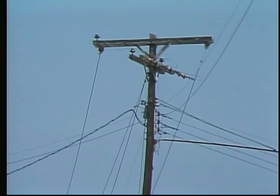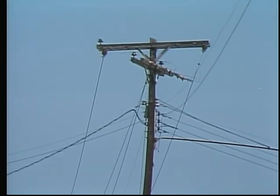Finding the balance of a utility pole, on the other hand, requires a good deal of experience. Utility poles are tapered, making them heavier at the base than at the top. Each rigging situation will have different balance requirements, and these are best learned on the job under the guidance of an experienced lineman. Our third consideration when planning a job is clearance and safety requirements.